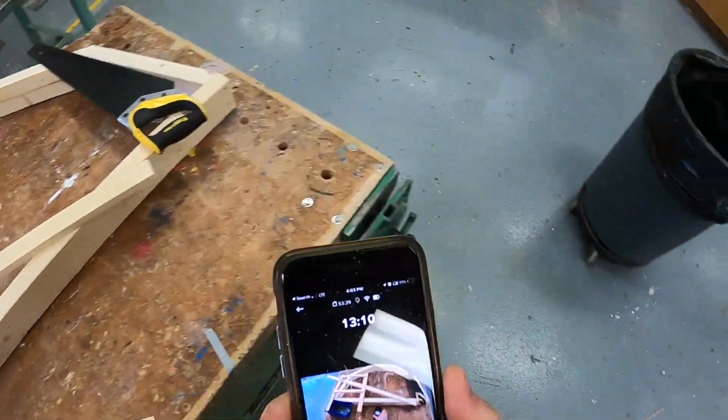While I was working, you should notice that my hand was on the table, this table right here. I'm pressing the piece down. You do not want to have an angle at your piece, or you'll end up sanding it not flat. All right, so I should have four boards that are now right on 23 inches.